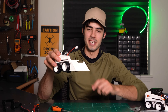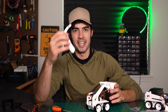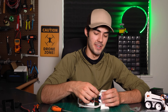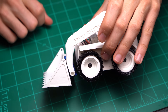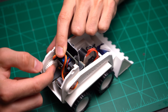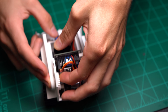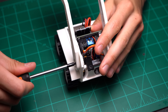You're going to hear the servo move to its initial startup position. Once we have that, go ahead and turn the mini Skitty back off. Now, taking the left arm and without moving the servo position, put it directly onto the servo, making sure the arm is pretty much all the way up against the bucket. Pop the servo horn onto the output gear on the servo. Then using the longer of the servo horn screws, secure the left arm to the servo. To lock the left arm in place, press the square end of the large gear outward from the inside of the main housing, rotate the left arm until you feel it lock in place with the large gear, then lock the two together with a medium-sized 2x8mm screw.